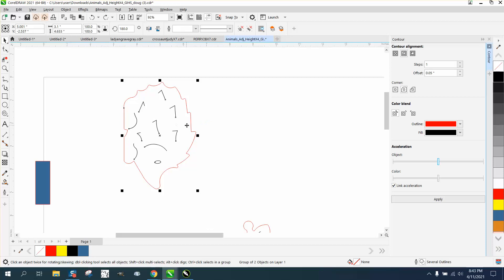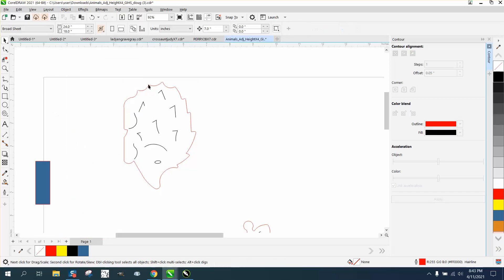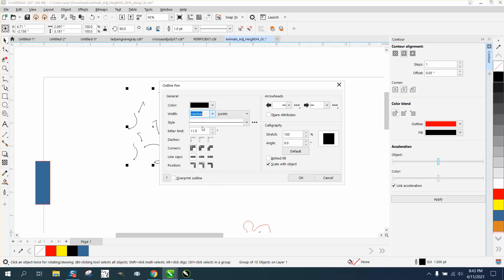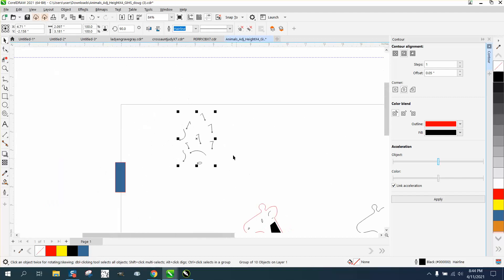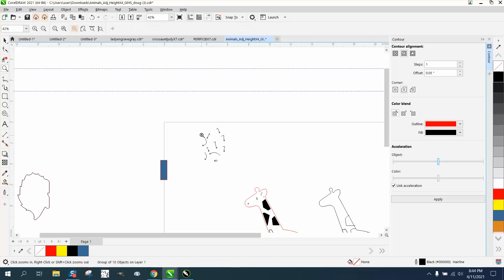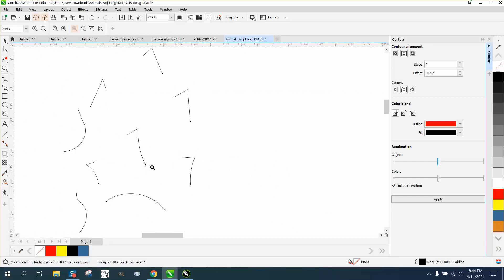That's still all grouped together. So you have this — you have your piece in there, you have it cut out. We'll just go to Object, Group, and Ungroup. You could take that away, you don't need it anymore, and then take these and turn them into a hairline — also an RGB hairline. Somehow you have it on grayscale, but that might not be the case. So now we've got a black hairline. If you're cutting that out of half-inch pieces of wood, you could vector engrave this in like two seconds versus about half a minute to a minute to engrave it raster.